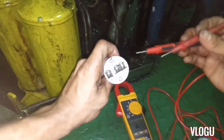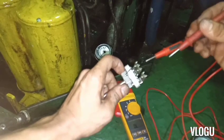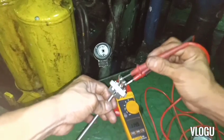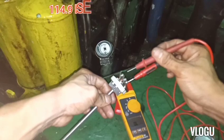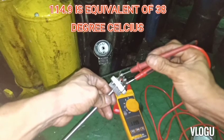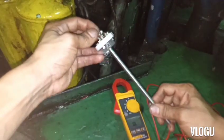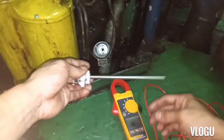We have only two terminals - one is a jumper, that's why it becomes three, not only two wires for this kind of temperature sensor. We have a reading of 114.9 ohms. In that case I think this temperature sensor is working, because the equivalent value of 114.9 ohms in degrees Celsius is 38 degrees Celsius. Because I removed it, I think it's the normal temperature since I removed it from inside the tube. I'm not sure if this is the problem - maybe this temperature sensor does not give accurate reading.